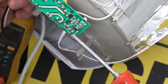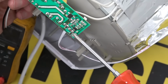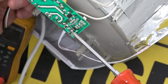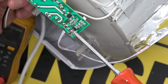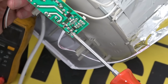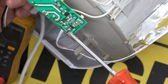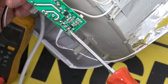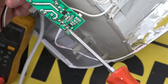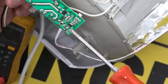I probed it with an ohm meter, 5.5 ohms either direction, which would lead me to believe that this is a current limiting resistor, and that it's encapsulated in, no, very likely it's a thermistor. That is, it changes resistance with temperature. So as the temperature goes up, the resistance would go up. That's a negative bias, or no, positive bias. No, negative bias. Either way, temperature changes, resistance changes, which limits or allows current to flow. You would want this if the board started getting hot. You wouldn't want it to burn down your hacienda. This is a protection mechanism in order to prevent one mode of failure.